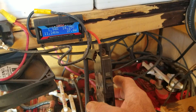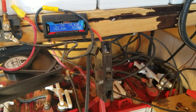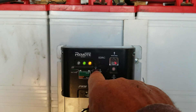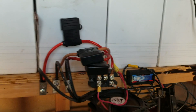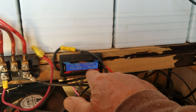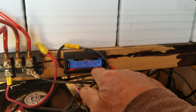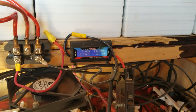On the positive I put an inline DC breaker in here. There's the click — you can see the yellow light on. I am dumping electricity right now because I've got way more than I need. I was just putting out 100 to 101 watts there, really doing 124 to 150 watts. It's really supplying me all the electricity I need.